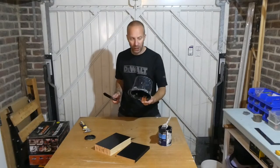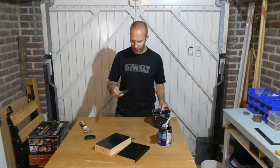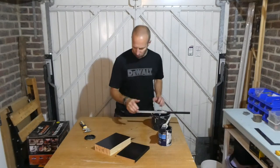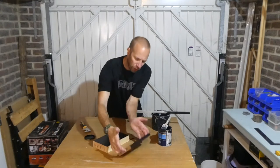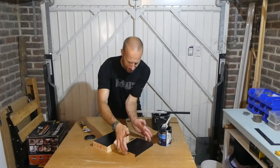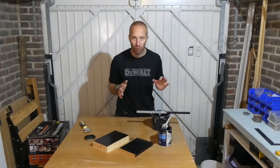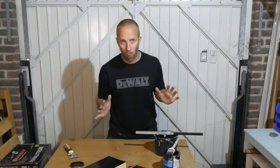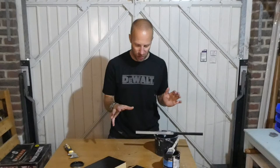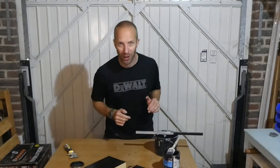So we've got the plastic and we don't need to do any more on that. We've got the aluminium, the metal - that's looking okay. We've got the softwood and we've got the MDF - I'm quite excited about the MDF for some reason. But what we'll do, we'll leave this to dry now. It does take four hours according to the tin. But in warmer conditions you could definitely get away with less time, particularly between coats. So we'll give this a few hours to dry, give that a very light sand, and then we'll apply a second coat.